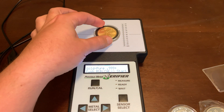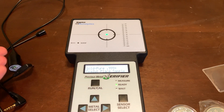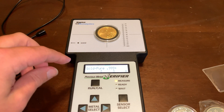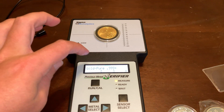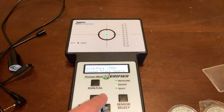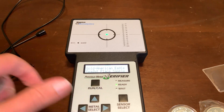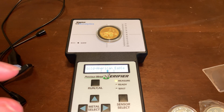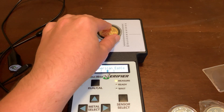If I put this on here — you click run cal, then it says place sample, so you put the sample on there. The way you can tell it's not matching up right is with this arrow on the right. It's showing you that this is not pure gold, which is good because American Gold Eagles are 22 karat gold. If I go over to the American Eagle setting and run cal, you can see that the black bar in the middle of the brackets shows it's right in the range where it should be — right in the middle — so you know that one's good.